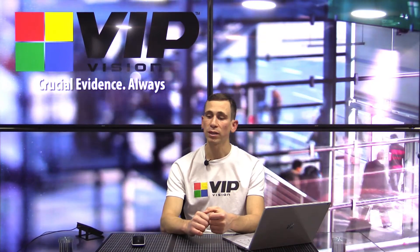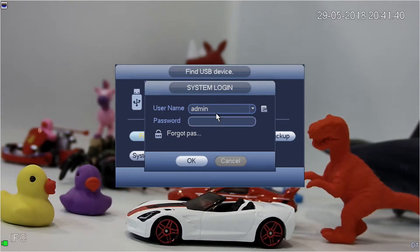That's completed and now the recorder is actually restarting. We'll wait for it to reboot — everything's gone well, it's updated. Once it fires back up we'll check the firmware version again. Now the recorder has rebooted and we're being prompted to log in. Note that we no longer have the six eights username and password — that was removed in security updates. You must log in using the admin username and password or any other account that is not six eights. If you've forgotten the admin password, you can use the forgot password button to use your recovery questions or a registered email address.